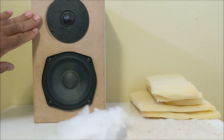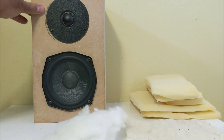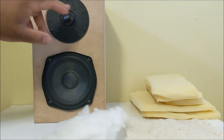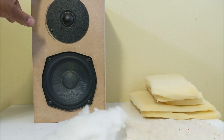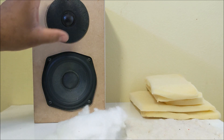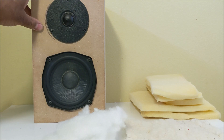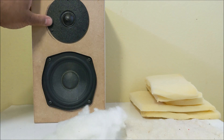The biggest change is two things: the original LCR was a sealed cabinet design, and this new version is going to be a vented cabinet design. It's also going to have a new composite material faceplate, which will help dampen the tweeter sound so it's more subtle for a cabinet this size, and it'll be very stiff material so it won't flex under high pressure and won't distort the sound.